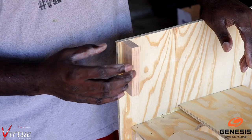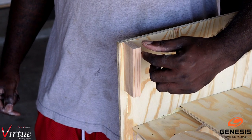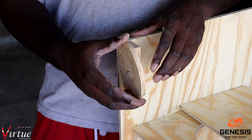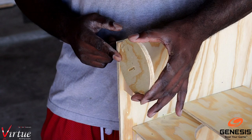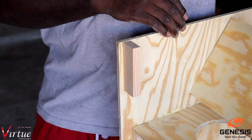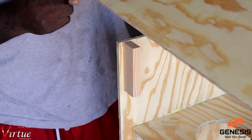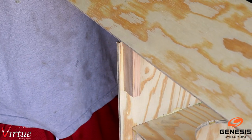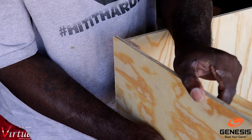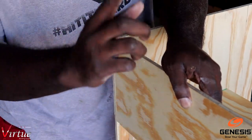This piece here, the inch and an eighth, is going to be the inside or the furthest line this way. So that way when you put your backing material, that's screwed there and that's flush now. Just like that. So what I have to do is your 8-inch pieces. I forgot because I put the shelves on. This was a true 48-inch piece, so I had to take about a quarter of an inch off of here. So now it'll fit right in between and lock us in the square. So let me reverse the angle, screw this in, be right back.